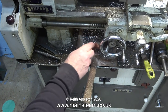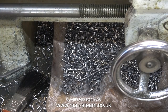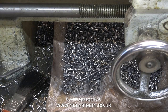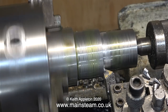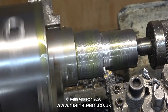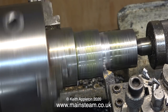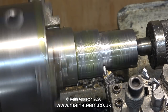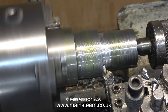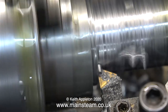Here's a good tip: I use an old shovel in the chip tray, so all the chips fall onto the shovel, and then I empty the shovel in the bin. I never can find the time to keep my lathe in pristine condition. Back to the job — as you can see, because the lathe is running slow and taking a very deep cut for a lathe of this size, the finish on the work isn't too good. This is known as a roughing cut, and the tool itself isn't very sharp — this carbide tip has been in use for quite a while.